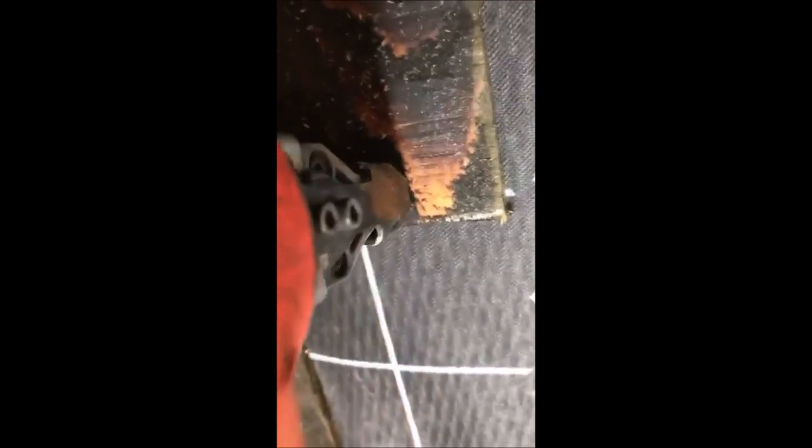So I've got the plank here, it's all cut. You'll see it won't line up because this below one was actually off a little bit, so I had to angle that nail in diagonally to get it into the membrane there. I do it about two inches from the top - I've seen on Google where people do it two inches from the bottom, but they're just so thin. It's a big crack if I do it any lower, and this has been working for me.